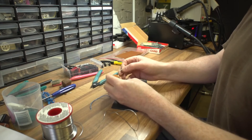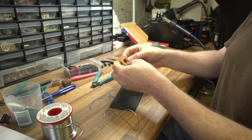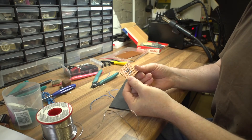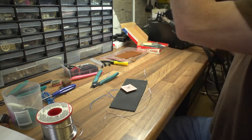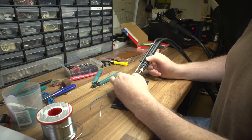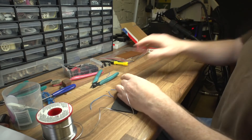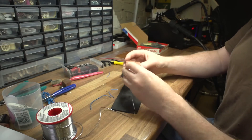When you get used to using the board, you get a feel for where things have to go. If you're just starting out and trying it, you might have to experiment a little bit and decide where you're going to put the links. But after a while you start to visualize it. There's probably some fancy software or a website which will take your schematic diagram and convert it into a Veroboard layout - I think I've seen something like that before.